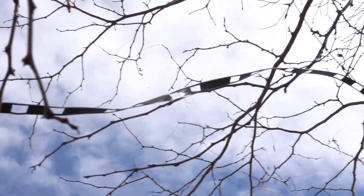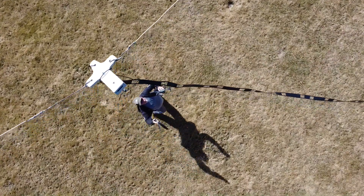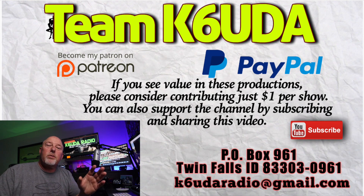The other thing: all that ladder line in the air needs to be suspended and not touching things. If you can keep it from sitting on your roof or stapled to a building, that will help you immensely. The beauty of having that balanced line out there is you could literally run a thousand feet of it. Ladder line has essentially no loss — coax has loss for every foot or yard, but with ladder line you can run thousands of feet and it'll carry the whole signal.